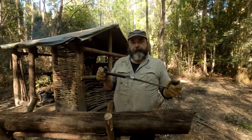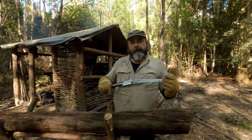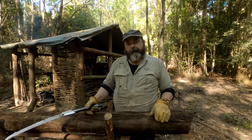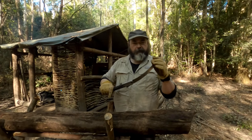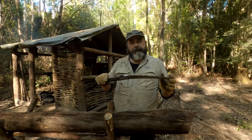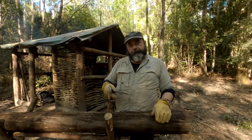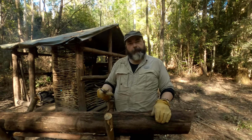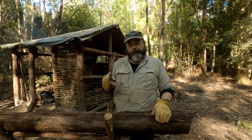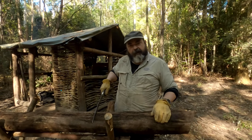When I got this, the first blade it came with was a straight blade — I think I busted it by the second or third camp. They're quite thin, flexible blades, really high carbon steel. It's a Japanese blade and very typical of Japanese saws — it cuts only on the pull. That frustrates me sometimes because on the push it doesn't cut, so you're only getting results on half the effort compared to a push-pull saw.